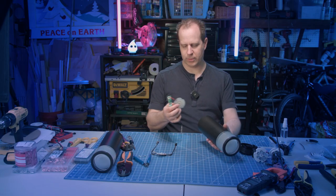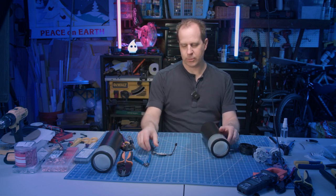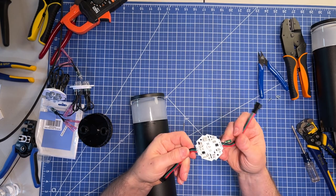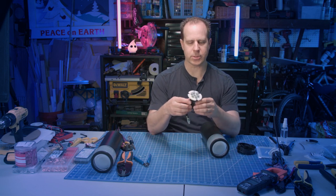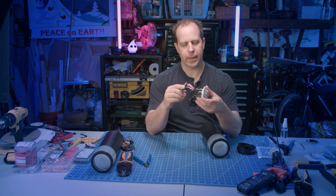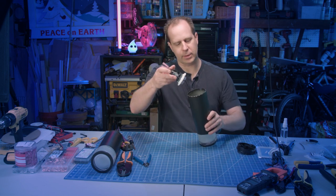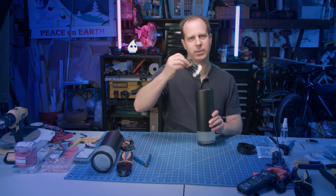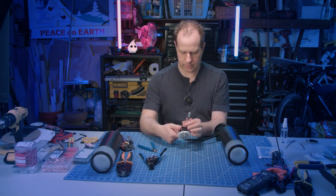So now that we have the white LEDs out, we can put in our own LEDs. There are different types of LEDs you can put in — for example, a higher wattage one like a three watt LED. But I'm going to use something that I 3D printed to hold some pixels that we have for some of our Christmas lights. These are bullet WS2811 pixels. So I just printed a little piece here that will go inside of the light, drop down into it, and then I'll be able to screw it down in the same spot as before.